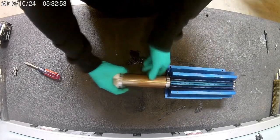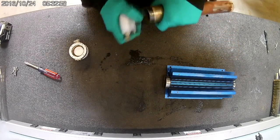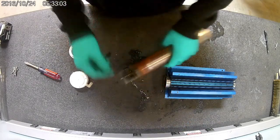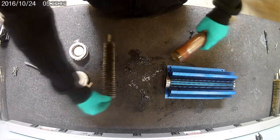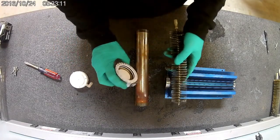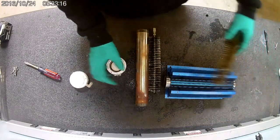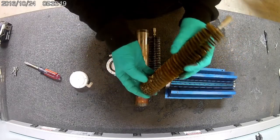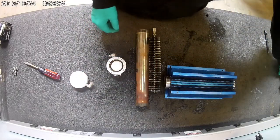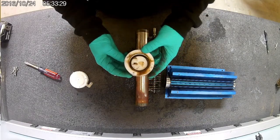Once you have it like that, the whole glass comes out. And you can just pop that off. Get your brush. And your metal shim is inside. Sometimes these brushes and these end caps get really dirty. These are fairly dirty. Brush is pretty good. But sometimes they'll get like this where the end of the bristles are kind of melted, and you'll just want to replace that brush if it's looking like that. Or if your end caps look like this, you just want to replace them.